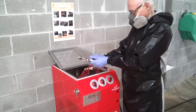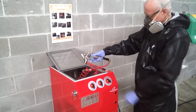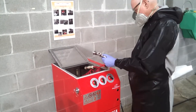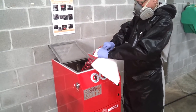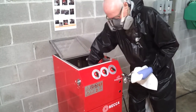Finally, let's review the process of drying the spray gun. With the air still connected, trigger and shake the spray gun to expel the solution. Wipe down the outside of the spray gun and disconnect the QD. Replace the air cap.